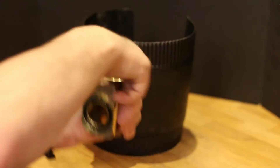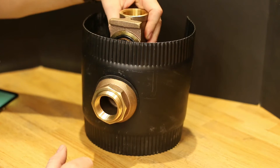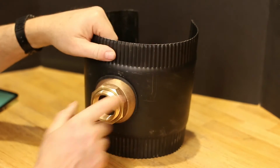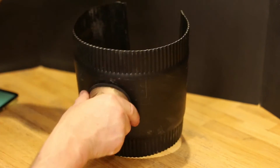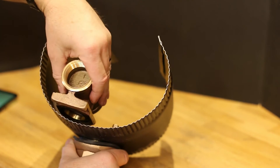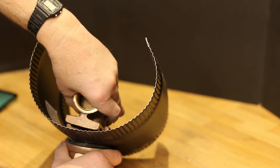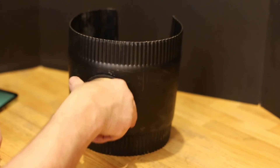I just have two handles on it, and then you lower the whole assembly with the pump into the well. You line it up with that adapter — we marked the outside to show which one was top, and that's easy to align. What I did is I stopped at the top and marked my tool at the top of the casing to make sure we got it seated all the way. It slides right in there — and that's a pitless adapter.